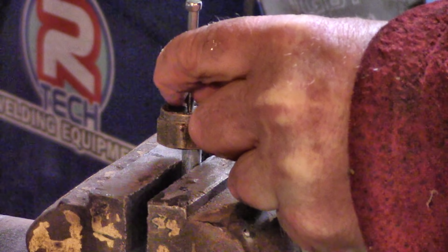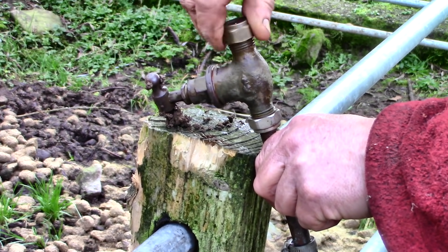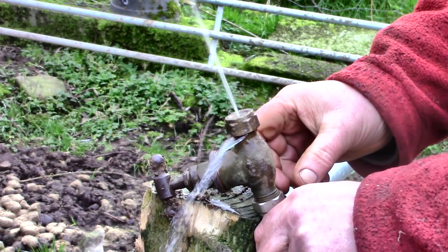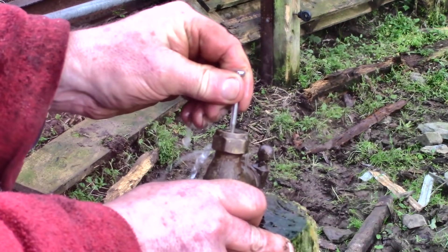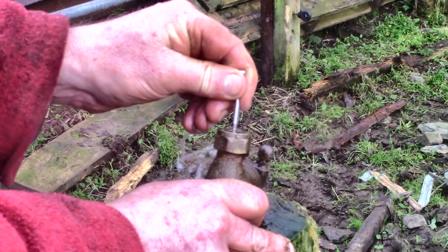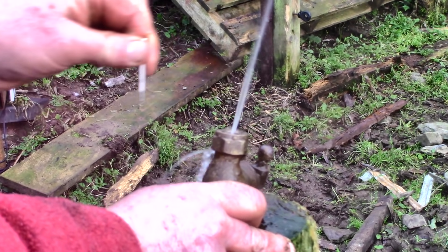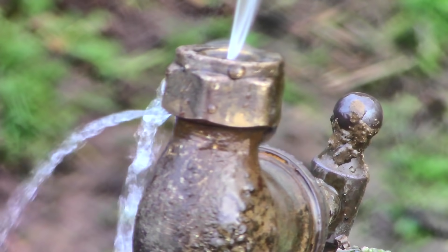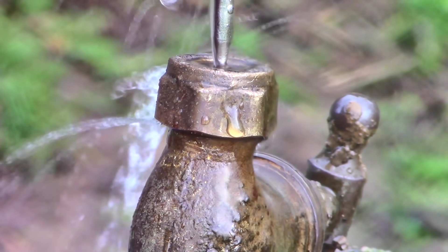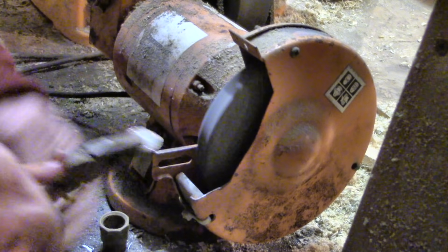So can I make something with what I already have? I rummaged in my plumbing box. My initial metal pin-in-a-hole plan didn't work because I couldn't push the pin in hard enough — and remember, I won't be doing the pushing; I'll be relying on a float to push the pin up into the hole inside a bubbling box of boiling water and steam. The water in the pipe is at approximately two bar of pressure — thirty pounds per square inch — so to stop it coming through the hole you need to match that pressure and more. The smaller the hole, the easier it is to close, so I found an old Irish penny and ground it down to the right size.